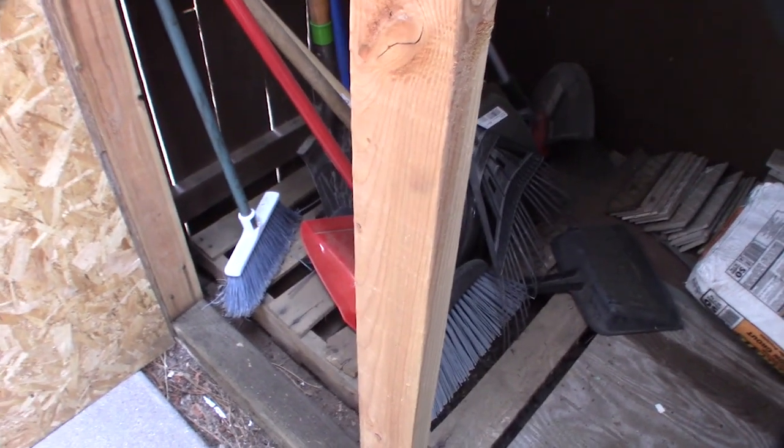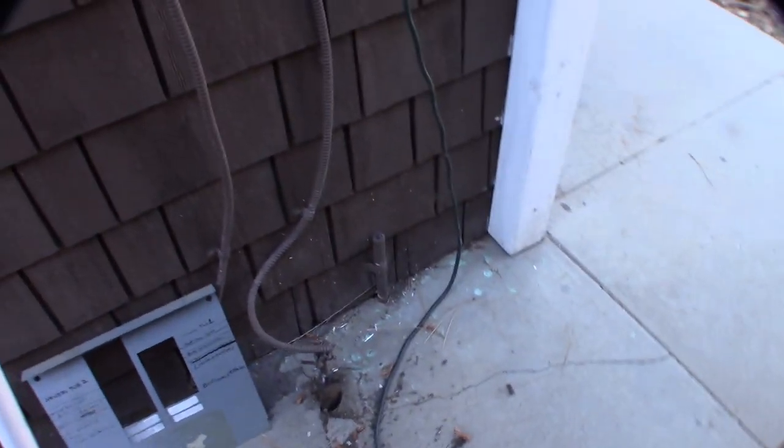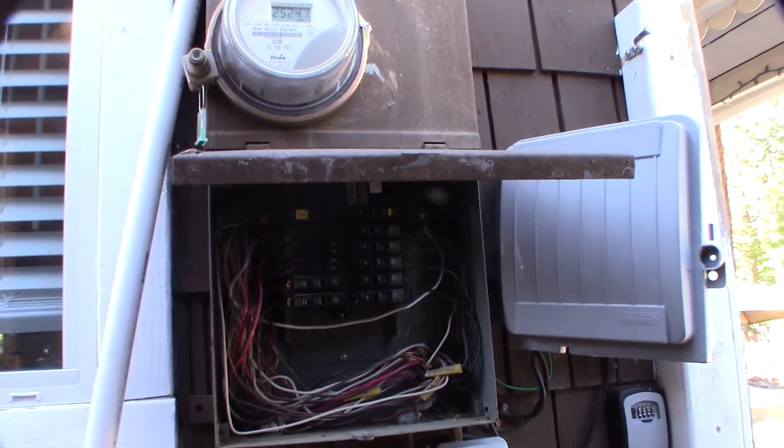There's no lights, no power — there's a skylight that helps a bit, but I need to get power in here. I brought my electrical box from where I live at the beach. I'm going to run the conduit, dig a trench over to the shed, create a little PVC water jet, bust a hole in that concrete right there, and come up to this electrical box. I'm running one conduit for power and one for data.